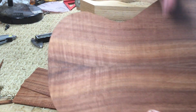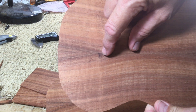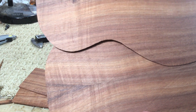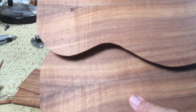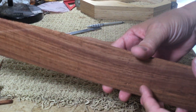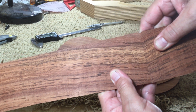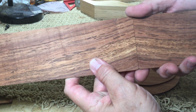This one looks like it's matching a little better, so this will probably be the inside of the book match, which will make it the outside facing piece. I still have to determine which one I want as the top or the back. This one's got a little knot over here — this might be a nice place to put the fretboard and use this as the top. The reason I'm mentioning this is once I get the sanding grits out, I want to really thickness it from the back side or the inside, because I want to maintain the face — the outer showing surface — of this piece of wood.